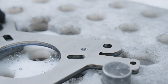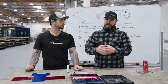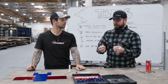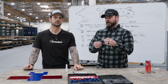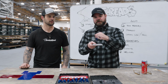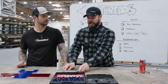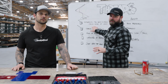We are doing a little bit of chip cutting as well, removing the excess material. But it's a very precise operation, especially in smaller diameters, like a really fine metric or whatever. You have to be incredibly accurate. Otherwise, when you put your hardware in there, it's going to be loosey-goosey, or you're going to go to put it in there and it won't go. So that's, again, why we size all the holes for you.